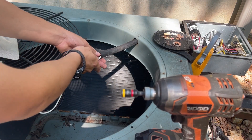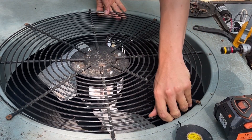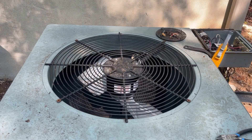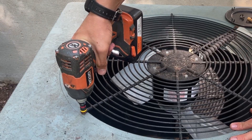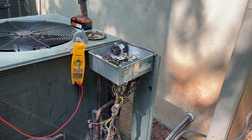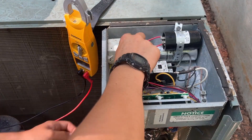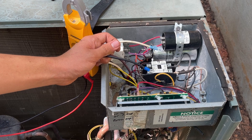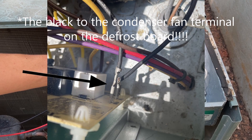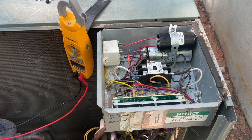Now I'm pushing these wires through and I'll go ahead and grab them on the other side. Now I can tighten these screws and the screws for the electrical box. Now I can go ahead and pull the wires through for the condenser fan motor. So I'll put the brown to the fan on the capacitor, the white to the common on the capacitor, and the black to the other pole on the contactor that does not connect to the common. Now I can tidy up my wires.